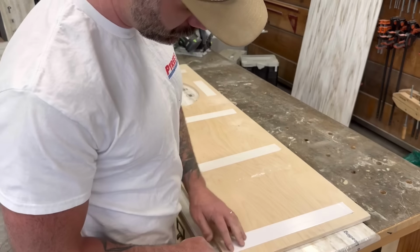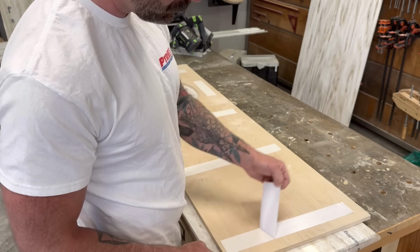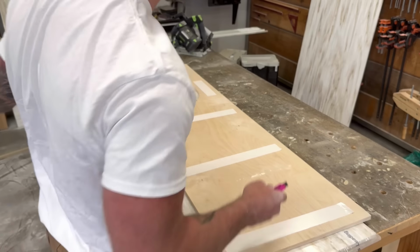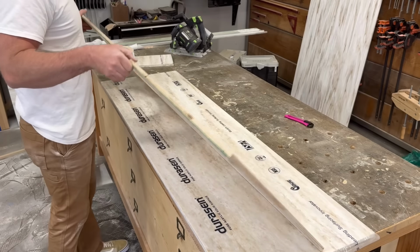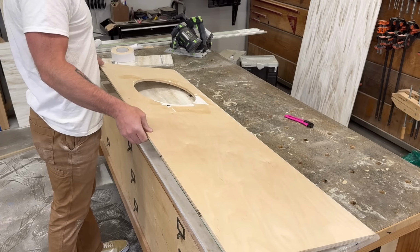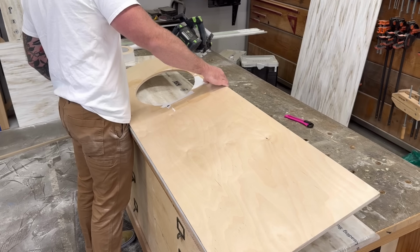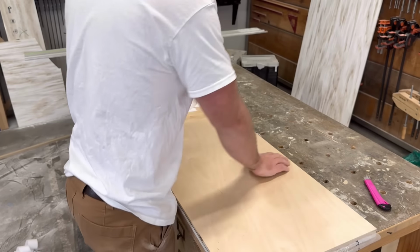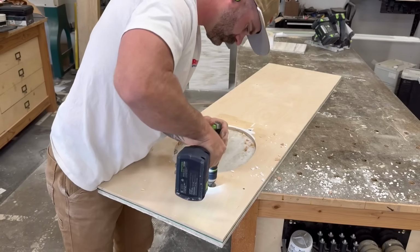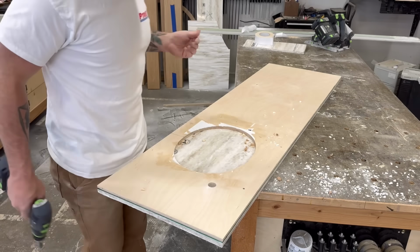Once I had the general overall perimeter shape of my plywood template cut onto the resin material, I used some double-sided tape to stick said plywood template to said resin material, and then it was time to cut out our oval for the sink. So very carefully, I flipped over that plywood, and very carefully I lined up all the edges, and then not carefully at all, I pushed really hard to make sure the tape was nice and sticky. Oh, I also drilled a hole through both.